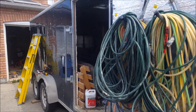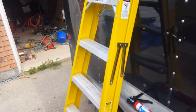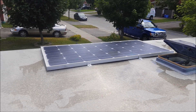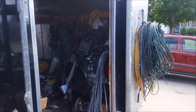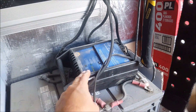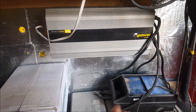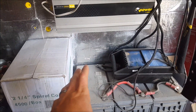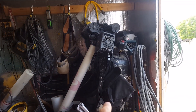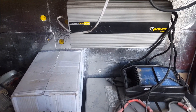Got the work trailer home this weekend doing some little upgrades to it. Just mounted a 125-watt panel to the roof, ran the wire through the vent and along the roof down into the system. I'm gonna keep this just for backup, but I got a 10-amp MPPT charge controller I'm hooking to the system so it'll be standalone and always charged. We actually use it quite often because I use a stand-up electric compressor.